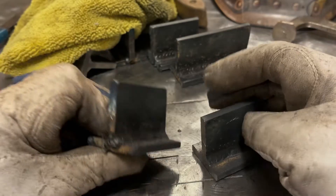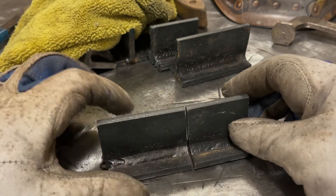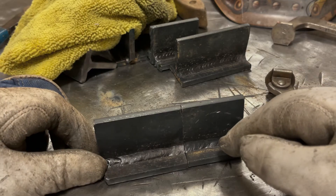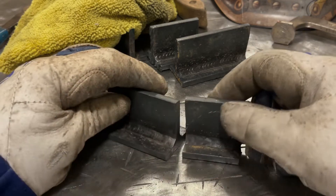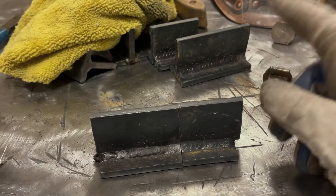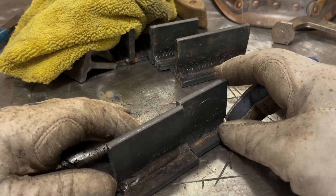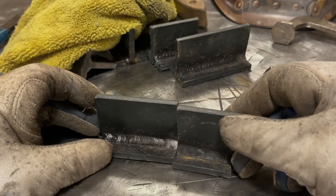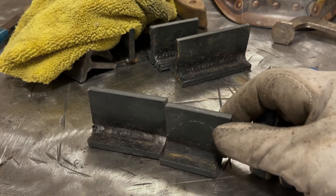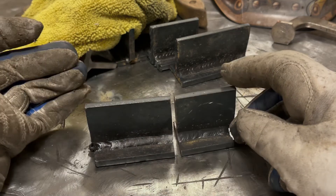I think it's a combination of things. The flux and wire setup of the US Forge with a 125-amp welder just isn't really going to work for a single-pass weld on something this thick with 0.030 wire unless you thin the weld out a little bit. The Lincoln wire overall — if I had to weld quarter-inch thick steel — I would definitely take the Lincoln wire for thicker metal with a 125-amp machine. Now if I had a 140-plus amp machine I'd be curious to see the difference. Running 0.030 wire on quarter-inch thick steel, you'd probably want to switch to 0.035 realistically.